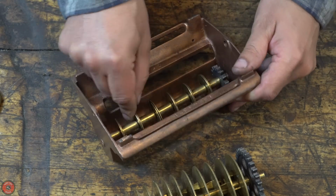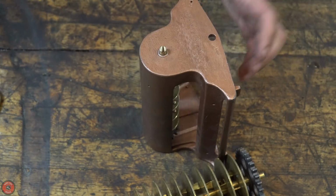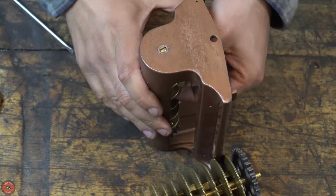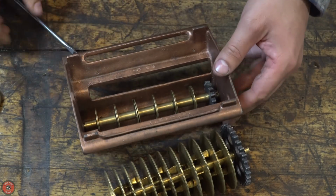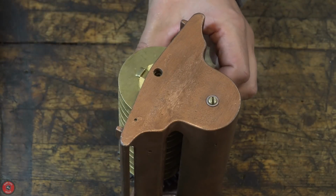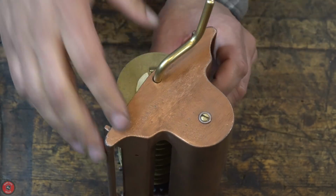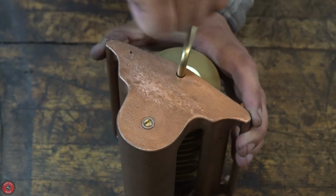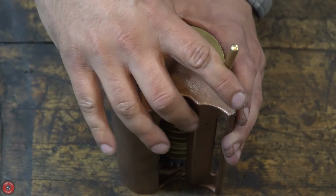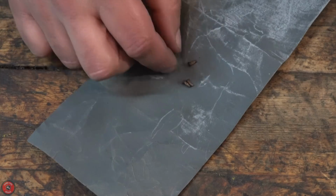So that fit in nicely into the new bushings, no wobble at all, obviously. It fits fantastically. Almost too fantastically. That's the concern I'm dealing with at this point. You could see how the top rollers and the bottom rollers shouldn't be touching, and that's why there's a specific way it is supposed to go back together. And once you screw the brass handle on, it's time to give it a spin, and it seems to be fine. Nothing's massively loose. Nothing is binding anywhere.